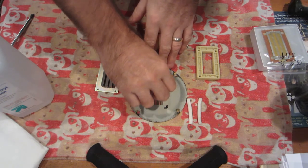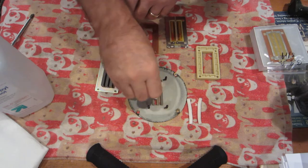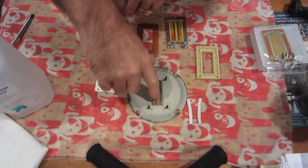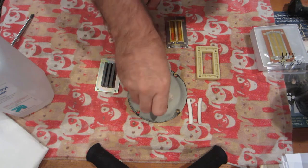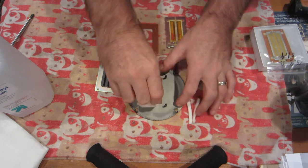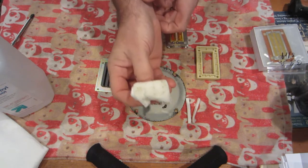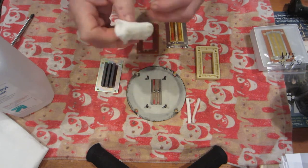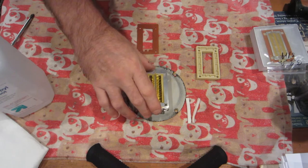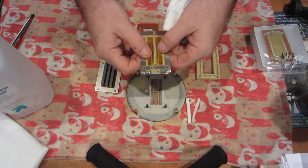What I like to do is clean the inside and then push off towards the ends — especially on the face plate one — because on these magnets there's a coating, probably a stick-on type coating, and you don't want to peel it back. Always try to push towards the outside so you're not pulling on the edges. As you can see it's not perfectly clean, so that's a good thing to do, because if you have residue the actual diaphragm will stick to the magnets, which will cause it to heat up and burn up basically.